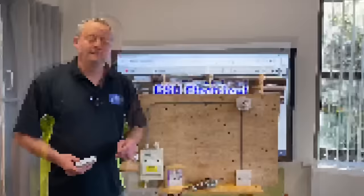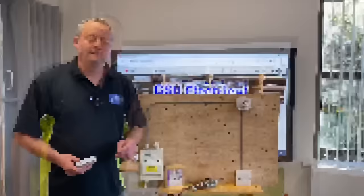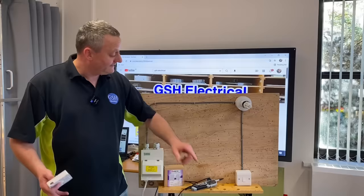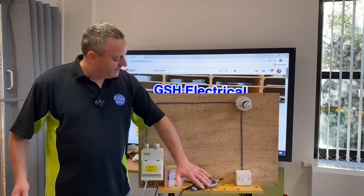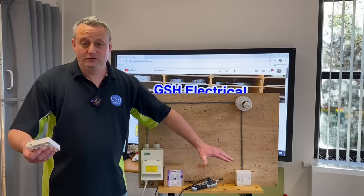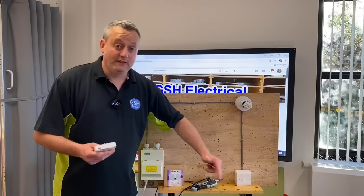It's almost like stepping back in time — I've gone back to a one-way lighting circuit, probably the first lighting circuit we ever carry out in an electrical workshop. We've got a one-gang one-way switch turning it on and off. We get stretched and go on to do two-way and then two-way and intermediate. We end up changing this one-gang one-way switch for a two-way switch, introduce a three-core cable and another switch, and then we have a configuration with an intermediate switch and three-core cables between them — but not today.